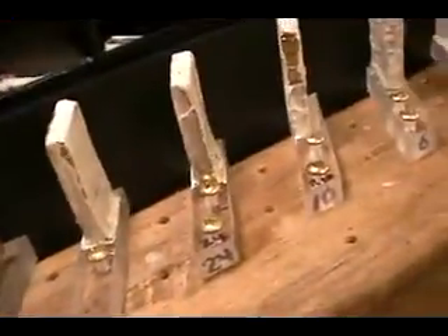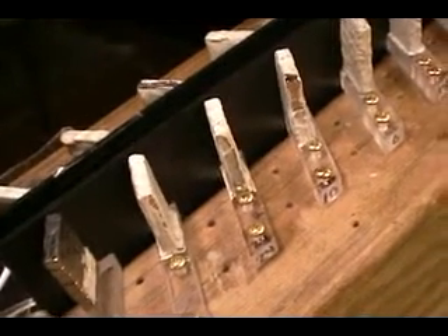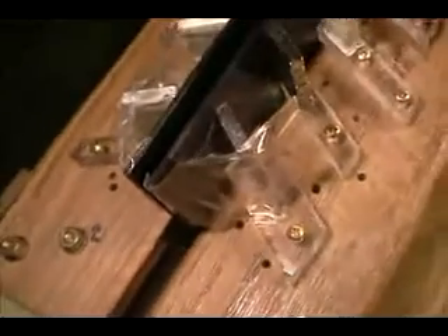It looks like paint on the outside — that just helped in the assembly process and is not really critical to the function. We have these stacks of angled magnets that look like dominoes on either side of this track. The track is just two sheets of plastic that keep the shuttle magnet from sticking to the stator magnets on either side.